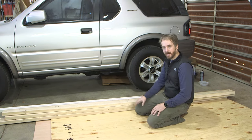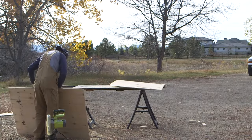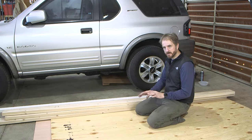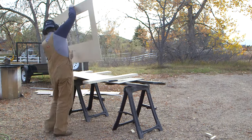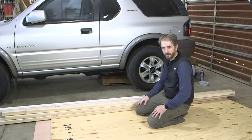On the back I'll use some half-inch sheathing, which will tie the frame together and give me something to bolt to the wall. To keep costs down, for the front of the fireplace I went with some quarter-inch plywood. Since the frame carries the weight and the back plywood holds it to the wall, the front really just provides a face for the fireplace.